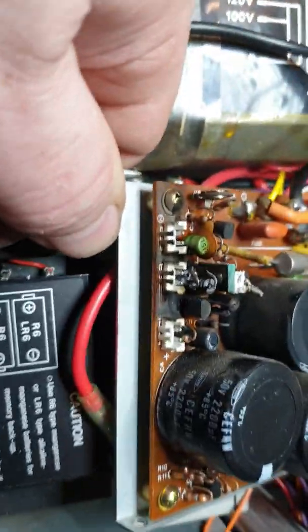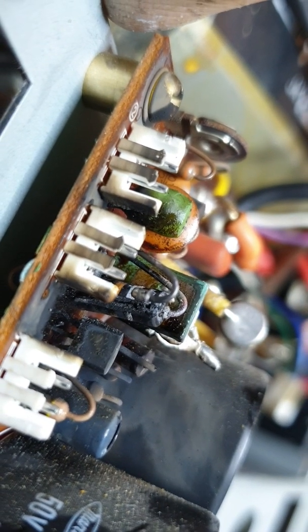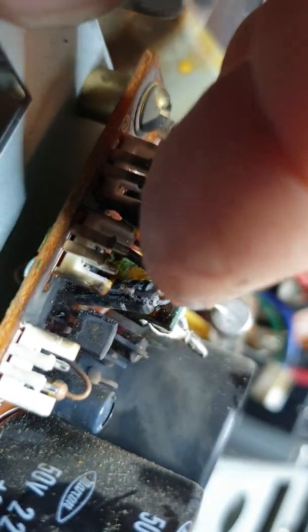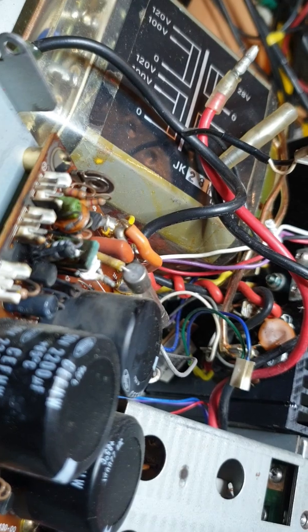I shouldn't be laughing, but — see that resistor's split in half there. So it wasn't the diode initially, because I said I thought it was a diode, but no — that's that resistor there that absolutely — that's the thing where the flames come flying out of. Initially this little inductor was sitting in the way and I thought that might have been part of it, but no. Then that diode — come to look at it — that diode's actually disintegrated. So maybe the resistor then disintegrated the diode — we'll find out when we pull it all out.